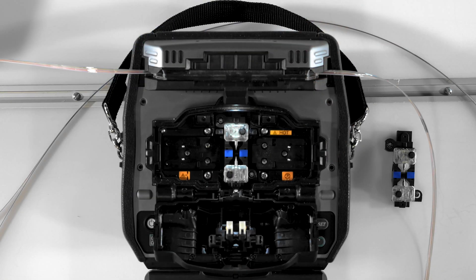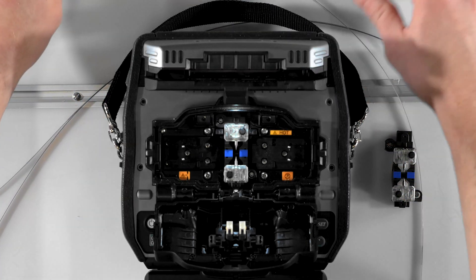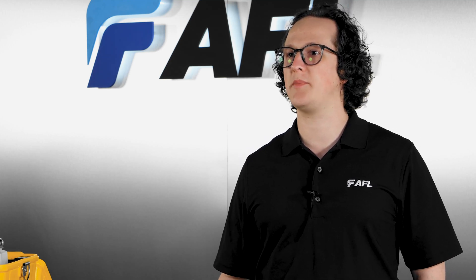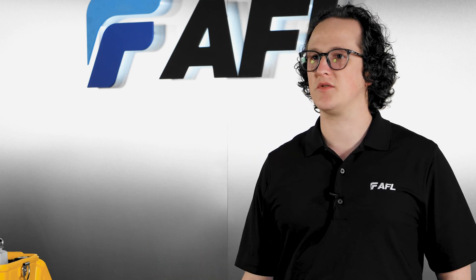When the heating cycle is finished, lift the protected splice out of the oven and set it down to cool off. It will be quite hot, so wait a minute or so before touching it. The splicing and heating functions of the machine operate independently of each other, so you're free to begin the next splice as soon as the heating cycle starts.